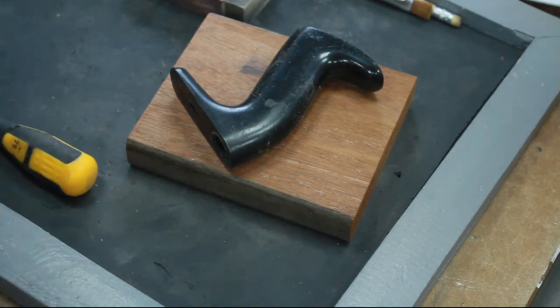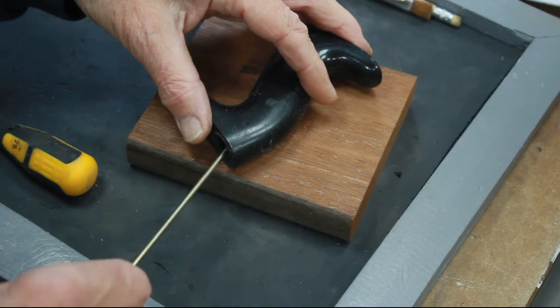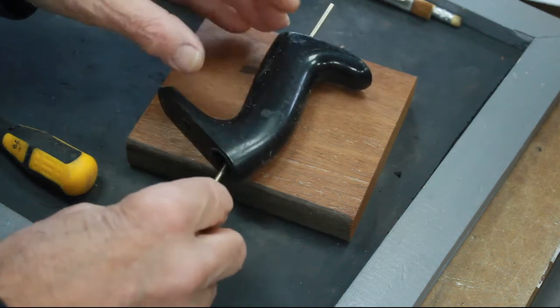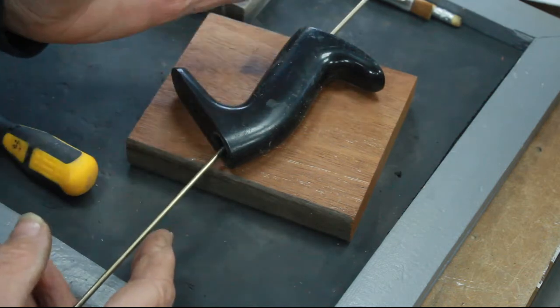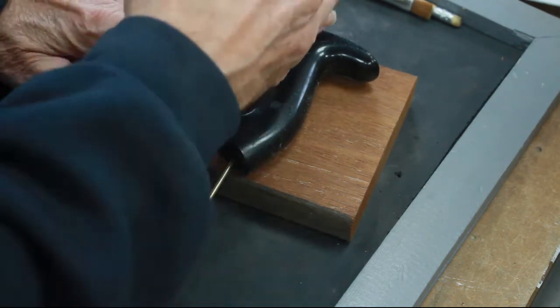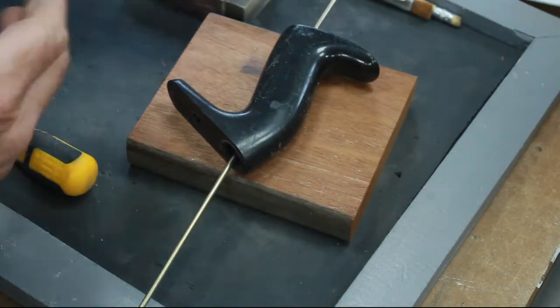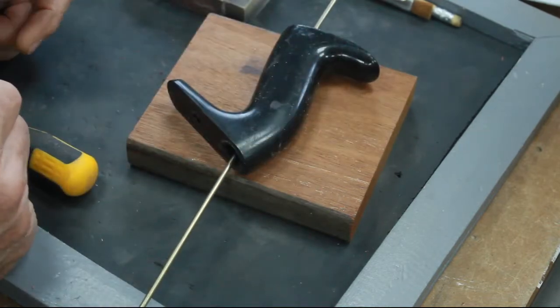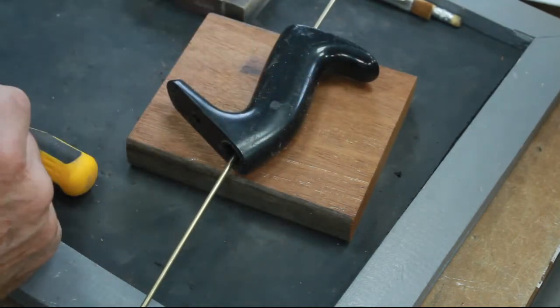Turns out it's none of the above. If you put a rod down the middle where the bolt is going, which is where all the compression is, it's not that way because it's slightly off. It's actually with that line at right angles to the grain, which is logical in that it's in compression and it leaves the most strength, I think, in these parts here.